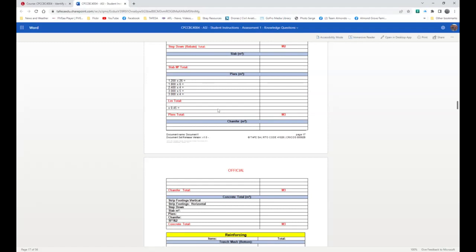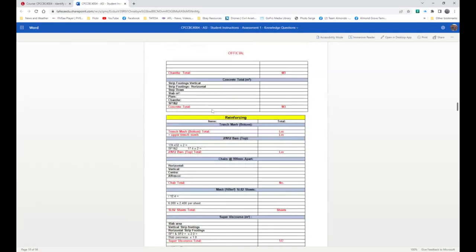Then what you have to do, and most people actually go into the calculator soup that I've provided, and you can go into there under columns and put in the right criteria, and basically it will work out exactly how many cubic meters for the piers. Okay, so there's 26 at 1.2, 6 at 1800, 4 at 24, 5 at 3 meters, and another 4 at 3 meters, just in a different section. Excuse me. This happens all the time.